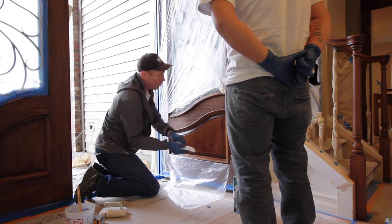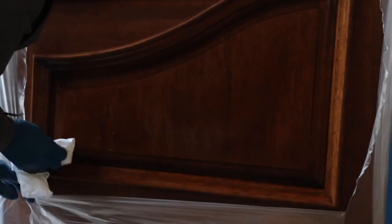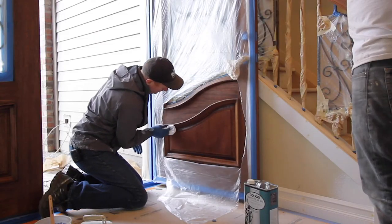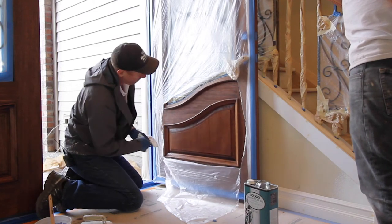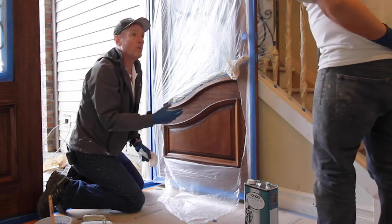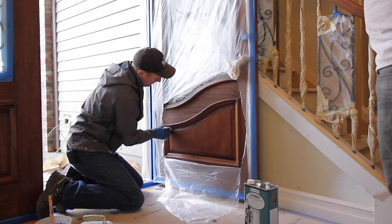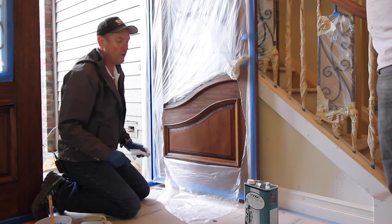I'll take this rag very carefully now to wipe up the extra. I'm checking to see if I'm getting any stain residue — checking if it's re-wetting. For this first coat I don't want to work it in really hard, I just want to make sure I get the excess off. These thin products can get trapped in the little grooves and they can leak out a little later. So in about 5-10 minutes you want to come back and check if it's leaking out, then just take a little part of your rag and mop up that little bit of excess. And after that, that's all there is to it — you've applied your first coat of Seafin Antique Oil.